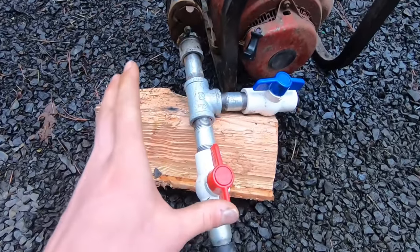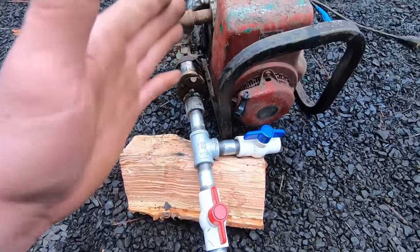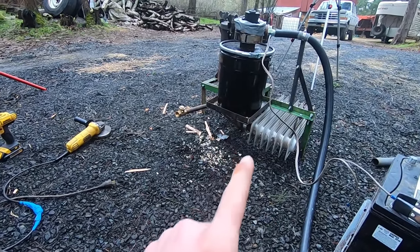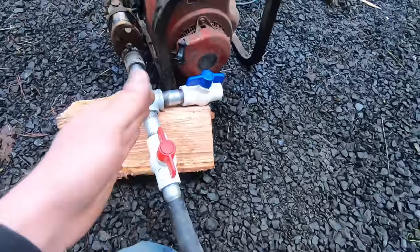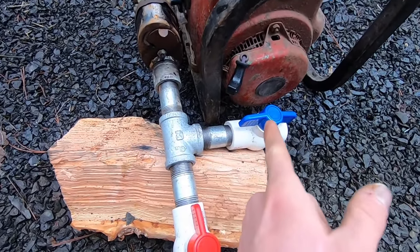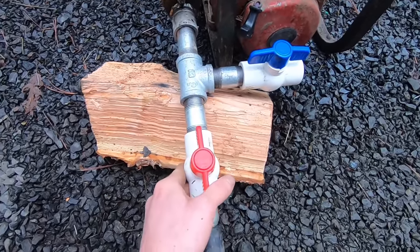So this is the traditional way that you would mix the gas and the air to get it to run in your generator. Inside of that gasifier, like I said, you do not want any stray oxygen, and so when it gets to here, there's not enough for it to combust inside of the engine. So what you have to do is mix in the proper amount by hand by using a valve setup just like this.